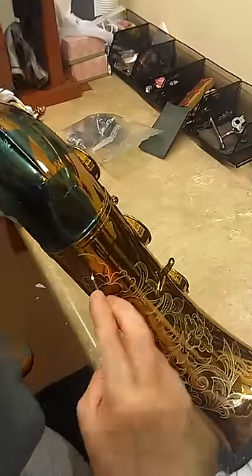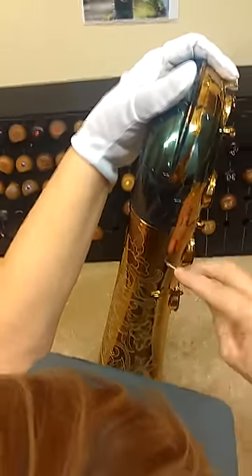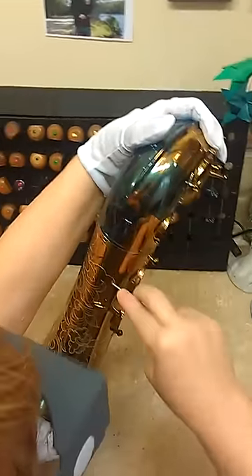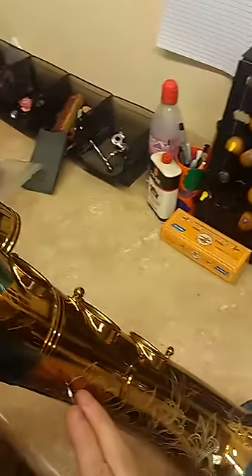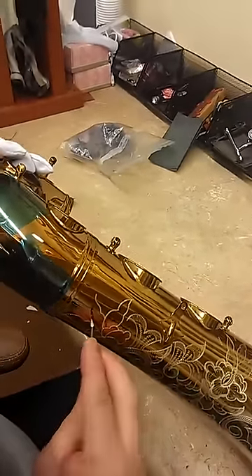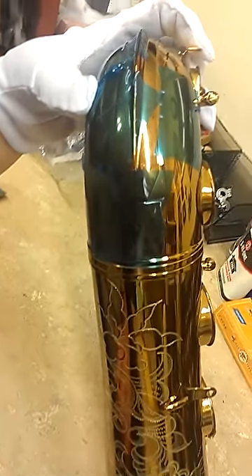As you can see, I went right through that outline and cut it right off there because that's the way I think it looks better. Now I'll have to work coming down to meet the other design. Instead of starting on the bottom I start on the top and work it down, creating a little bit of a decorative tip. Note how the brass and lacquer build up at the tip of the engraving tool — it's actually a solid kind of roll, and once I complete that line I just flip it off at the end with the flick of a wrist.